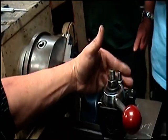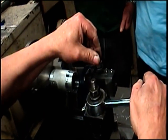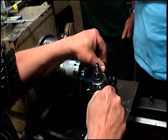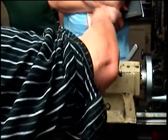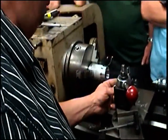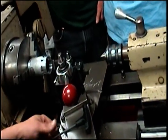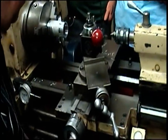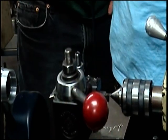The left-hand tool is going to go with the tool holder in the front position. I also want to remind everybody to open and close this — you will push the handle forward to open it, pull it to close it. I'm going to bring my tool and lock that down. In this particular case, I simply am going to take my tool and put it on the back side of my tool holder for the moment. Because my tool holder is held square with the tool post, I can simply lock it down, then advance the cross slide and raise or lower my tool as required.